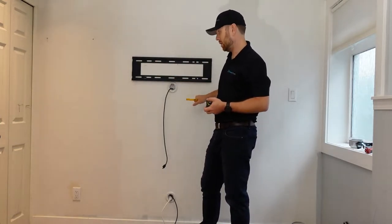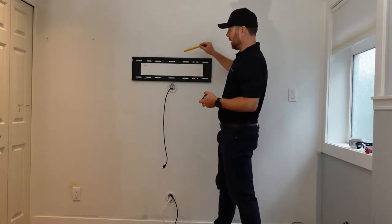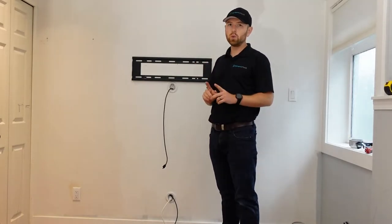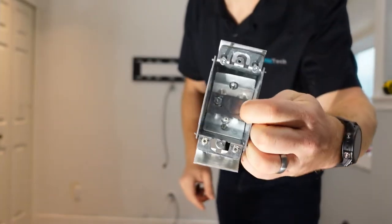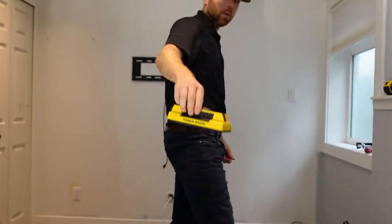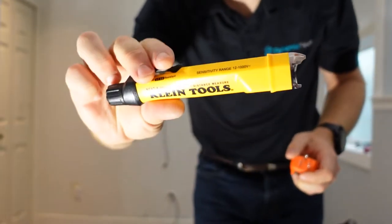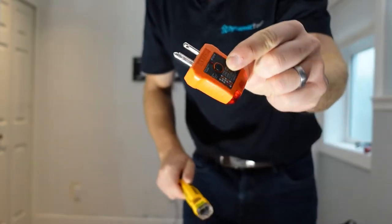This wall has insulation. If there's an outlet directly below the TV, you're going to want to build it straight up — it's very easy to drop wire in the wall vertically, but very difficult to run power cables horizontally because there are studs in the way. Here are the tools we need: an electrical reno box, a stud finder — I use this Franklin Sensors stud finder — some house electrical wire, a drywall knife, tape measure, wire stripper, a no-contact voltage tester to make sure the power is off, and a plug-in voltage tester.